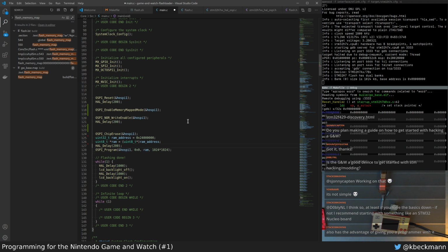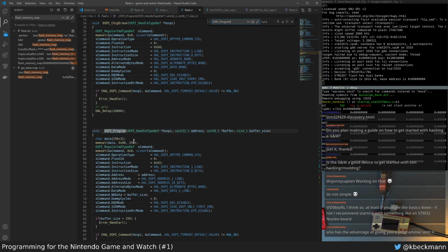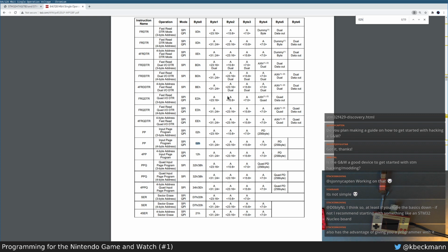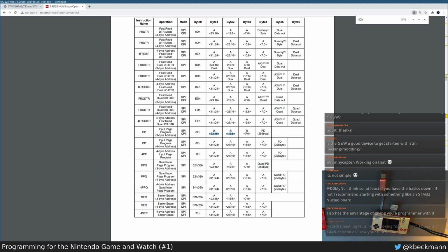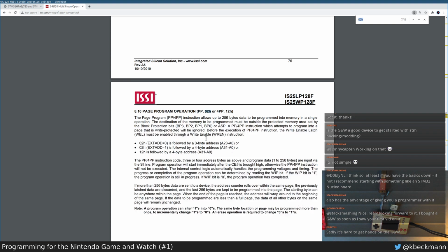Yeah, this will be fine. And then we need to adapt this command to be single SPI mode. And it is actually that already, right? The 02 command, as you can see here. Yeah, so this is like a cheat sheet, pretty convenient. You can see that in 24-bit mode, you only need to send 3 bytes of address and then the payload, 256 bytes. Or actually, is this QPI? This is a little bit confusing.